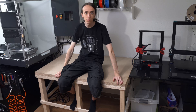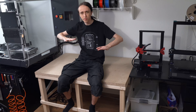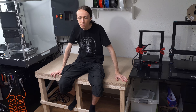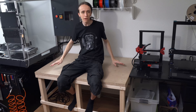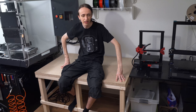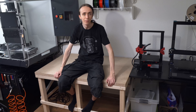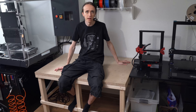After chasing my own tail for about an hour, I think I managed to get the whole table fairly level. The main thing was that one side was just a bit lower than the other, because the floor is not quite level — but it is not just slanted that way, so there definitely was a slight bit of twist that I was able to take out. Without any more weight on it, I cannot take any more detailed measurements, but I would say the flatness of this table should be at least within half a millimeter, which is quite decent. Once the CNC is on there and there's more weight, I can go in and fine-adjust some of the shims.